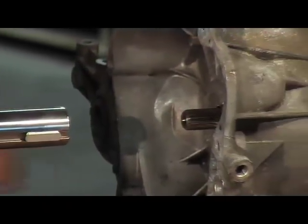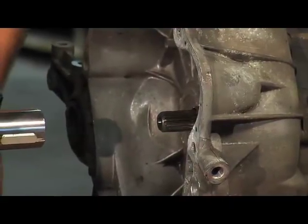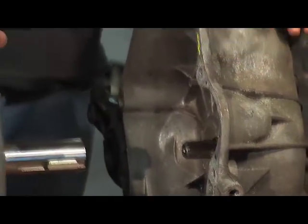The transmission is a little more difficult. The transmission was originally designed to couple to a clutch plate, but in this application I'm not going to use a clutch — the motor will couple directly to the transmission. The main thing a clutch does in a car is allow you to leave the motor running when the car isn't moving. With an electric motor, you can just shut it off. The other consideration is you want to minimize the amount of mass and weight that you have to spin with the motor, because that costs you energy, makes your car less efficient, and it won't go as far.